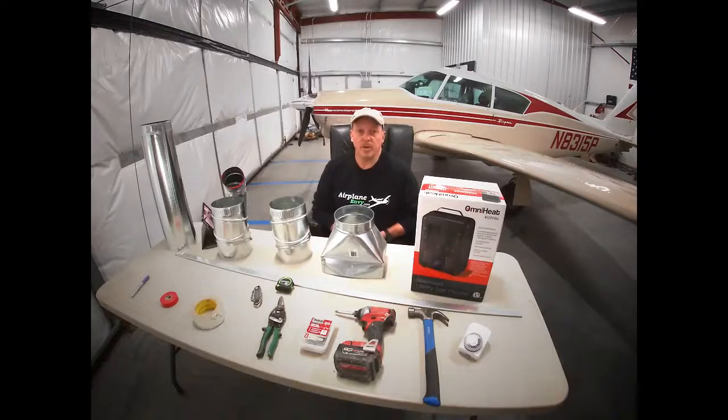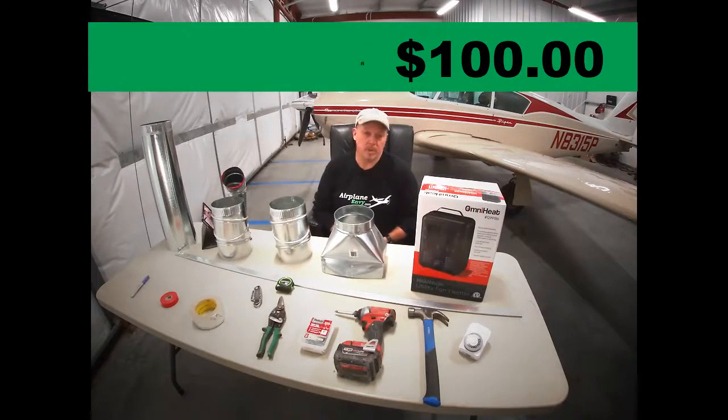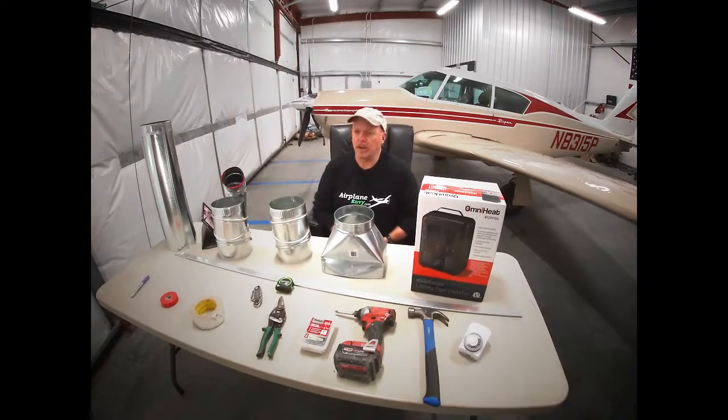Well, we got our first snow in the Northeast today, where I'm from, and I thought it'd be a good time to do a video to show you how to build a really inexpensive preheater for your airplane. These are really good for retractable gear because you can put the nozzle of the heater up in the wheel well, cover the cowling, and keep your engine nice and toasty.